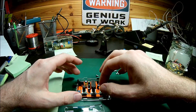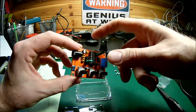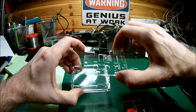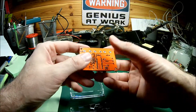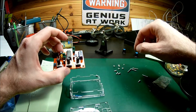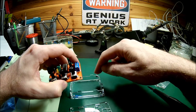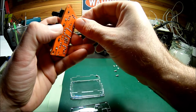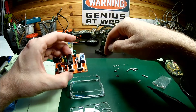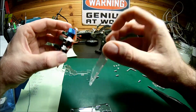I'll turn off the soldering iron — soldering is finished, all the components in place. As I mentioned, check the direction for the capacitors and the IC. I've just tried taking off the paper of this laser-cut acrylic so I can do some dry fitting. I noticed you have to cut all the component leads quite flush to the PCB to get this to work. I haven't read the instructions because I'm lazy. There are some really short screws, but they're too short to secure the PCB to the bottom, so I'll use them as standoffs so the PCB doesn't push against the back plate, and the screw pins go into the small holes to secure the PCB so it doesn't move around.